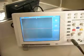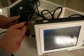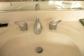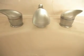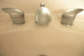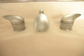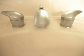I'm going to show you the instrumentation error that occurs on water systems when you use an oscilloscope that is actually connected into the electrical system. And the water system right now is actually currently grounded to the electrical system, and that connection is known as the neutral connection in America, and that's the utility neutral connection, which connects into the ground at the home through ground rods and becomes the ground connection.